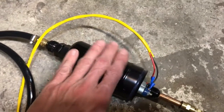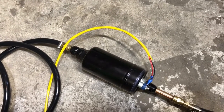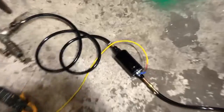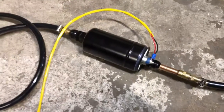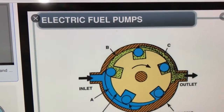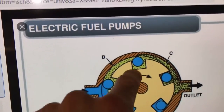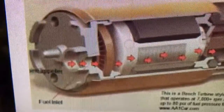This particular type of pump is cooled by the fluid — the fluid actually flows right past the armature and the brushes. In automotive, truck, and agriculture applications, they use what's called a roller vane pump — rolling elements that go inside pockets, either 5 or 6 slot pockets. It chatters the way that it would chatter, and the fact that the chattering can be changed makes total sense. That's how this thing is able to handle contamination. Here is a better diagram of the roller vane pump — that's why we hear that chattering. The beauty of this pump, what makes it so robust, is that these parts have so much play — look at the clearances in there. The other type of fuel pump, a high-speed turbine fuel pump, would not work well with waste oil at all.